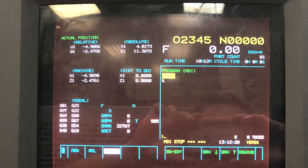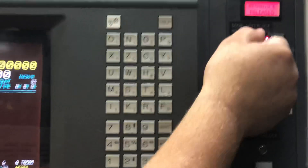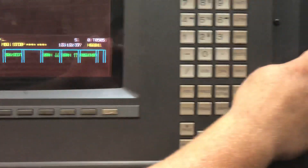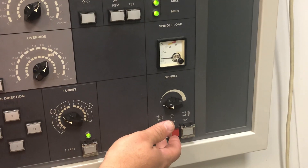During this process, we will not hit reset until we are done. To see what I'm doing, I will release my door interlock. I will also open my door and I will turn on my spindle. To do this, I must be in a manual mode, and then I will come down here to the bottom right and turn my spindle on manually.